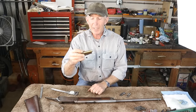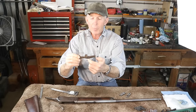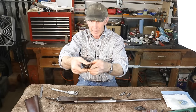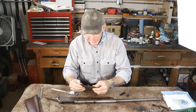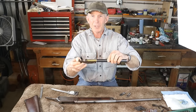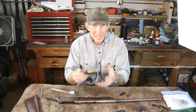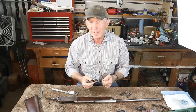The next issue was the cartridge stubbing on the bottom of the barrel when cycling the action. Looking down from the top we could see a break in the carrier right here. All the pressure is down on the bottom part of this carrier — this whole arm is held down here — so when it broke it bent the front of the carrier. Most likely a cartridge didn't fully seat into the carrier and the front edge was still in the magazine tube, and somebody got frustrated and just started cranking on the lever, breaking and bending the carrier. When your gun doesn't cycle properly, don't get frustrated and force the lever — a minor problem becomes a much more difficult one.